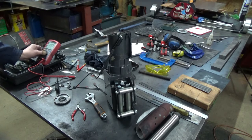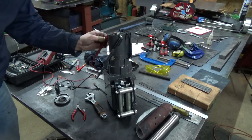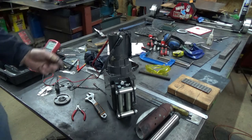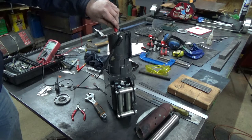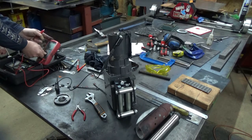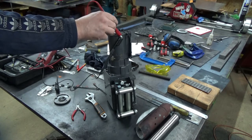Let's go for a diode check to start. Diode check will give it the non-latching beep. So we have continuity through the windings to the side. And insulation to earth. Let's try it in 20 mega ohms. Nothing showing. And of course that'll be zero. Perfectly zero there.